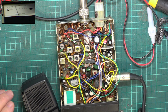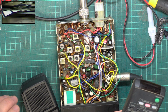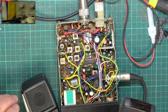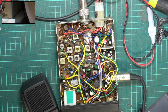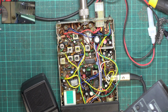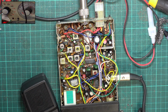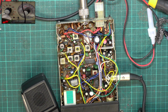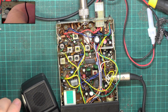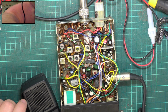So let's look at squelch sensitivity. So I'll just pop the camera down to the attenuator controls, or the bench. I'll have to get out of my chair to see the monitor. Okay, so we're going to park the signal generator at 0.3 of a microvolt, and we'll just listen for a moment. We can hear the signal generator at 0.3, 0.2, and we're losing it to about 0.15. But we've had some of the recent sets which have been still receiving off the clock there.